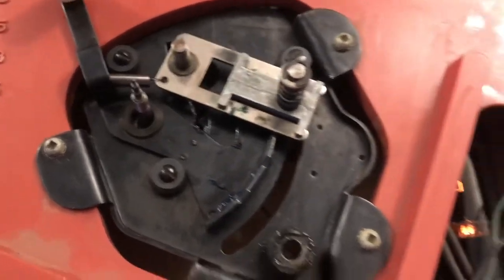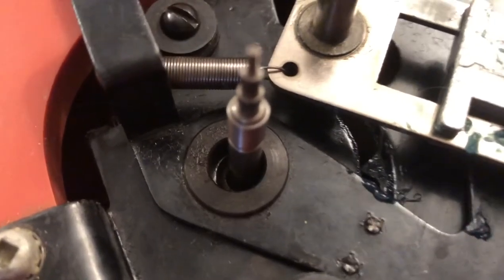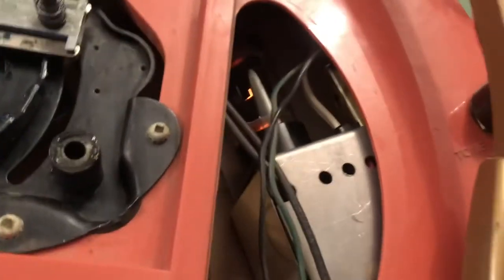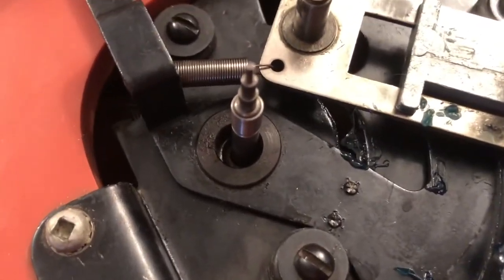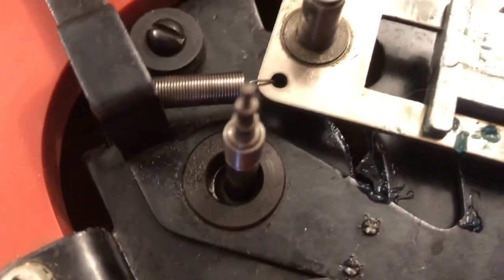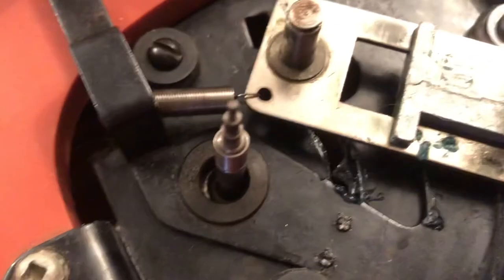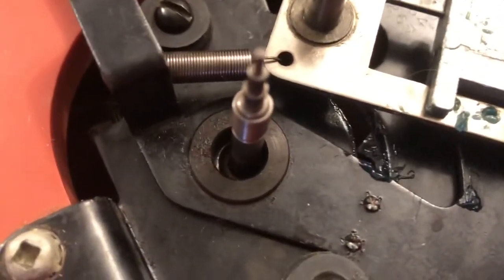Apologies for the washing machine in the background. I've got the motor together and I'm actually running it — the vacuum tube is lit up. I hear a bit of a humming sound from here, but that's not the caps. The caps were still good from what I know; they are the original ones. There's no humming coming from the speaker so I don't have to recap this yet. The motor seems to be running fairly smooth, but this is without oil, so I'm going to oil it and see what happens.